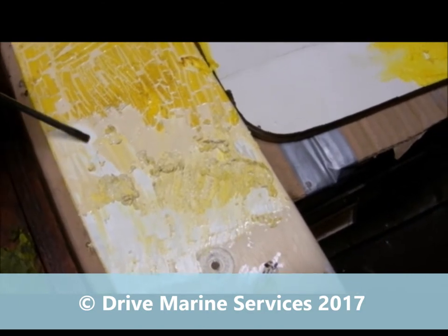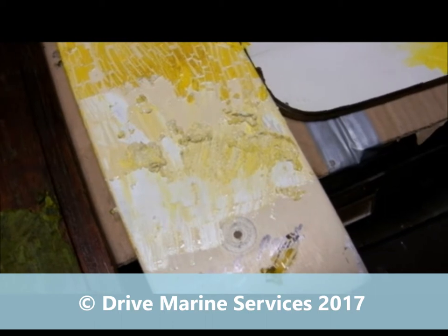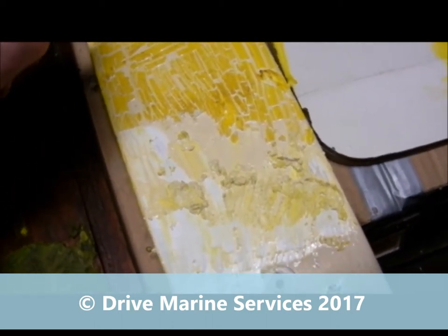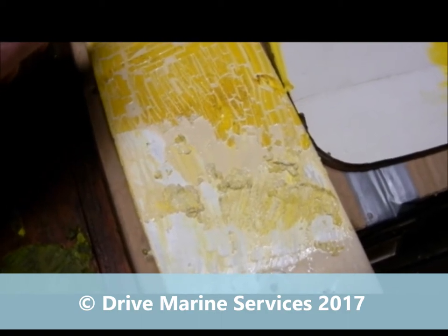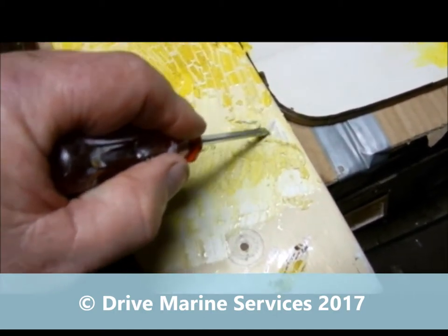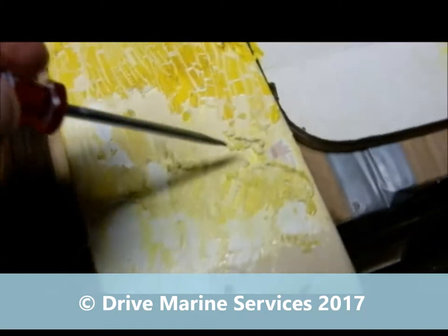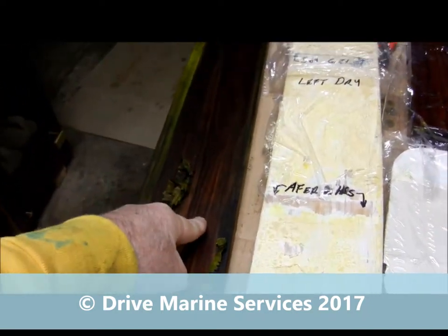You can see this one here — I lifted it off a bit too soon and it hadn't reacted properly with the undercoat. I'm going to leave it on these ones a bit longer. There's still a little bit of work to go to get right through that undercoat, so we'll leave it a bit longer. It's starting to get through here — we're pretty well through the undercoat, back to bare timber.